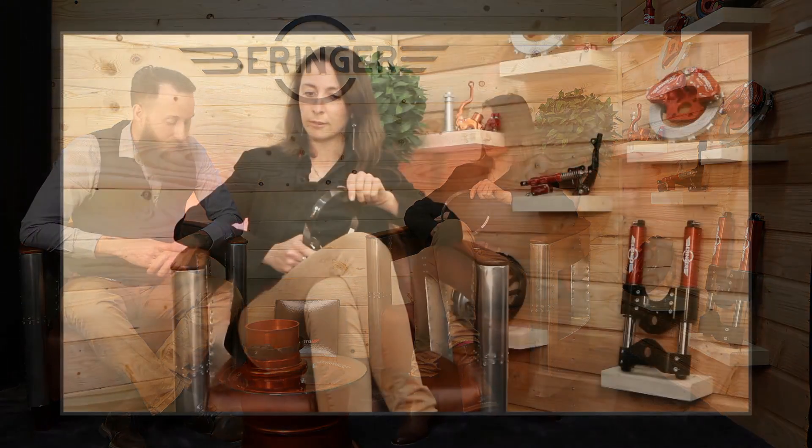You mentioned there's a counterweight — so even if the sensor rotates a little bit on the wheel, there's no problem of vibration or unbalancing, right? Exactly. That's one of the points we worked on. Otherwise we would have reduced the weight by removing the counterweight, but we do need it. If the sensor turns like this, it's always equilibrated within the assembly, so it doesn't matter where it is. And it doesn't damage the wheel — it's all plastic, and there is protective tape on the inside of the carbon band. We've worked on four sizes for now: four, five, six, and eight inch — pretty much covering everything. We will probably work on some other sizes in the future using the same system.